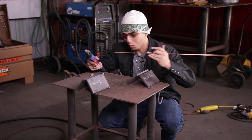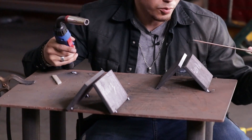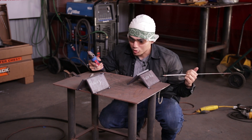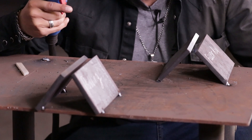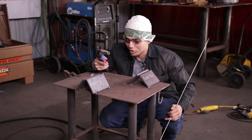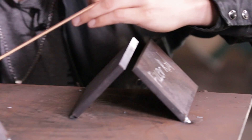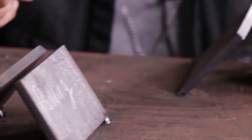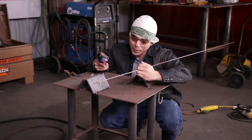Alright Weld 2 family, we have here two different plates — 3/8 plates and 3/8 plates. Same plates but different gaps. A lot of times in fabrication shops — this happened to me when I used to work there — you don't always get the best fit. We're using GMAW today because that's what I worked on, and a lot of times if you're going to pad big gaps you're going to use GMAW. I have about an inch gap here and about a half-inch gap here. So I'm going to fill up these gaps, and the first method is padding.